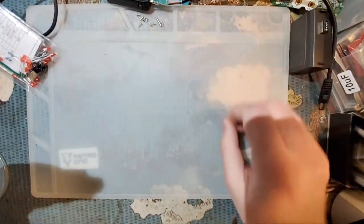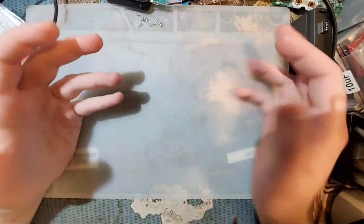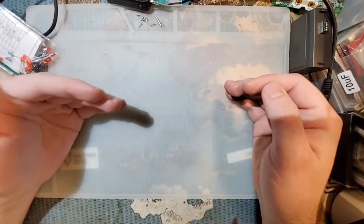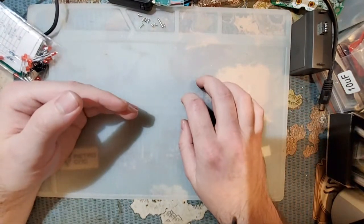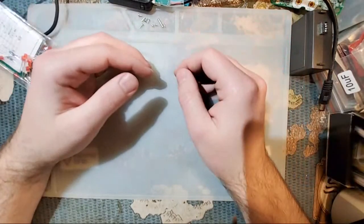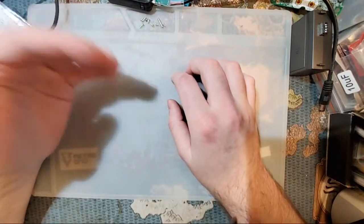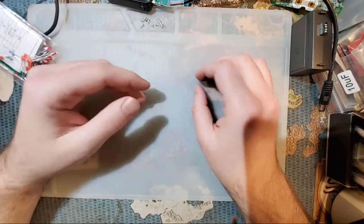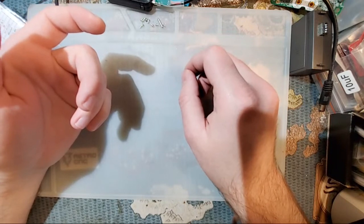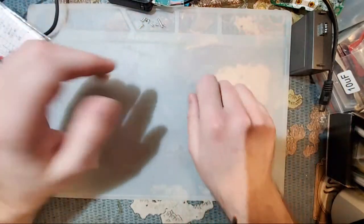Game Boy modding. Soldering is a very important part of Game Boy modding. A lot of backlight kits, if they don't require soldering, it's still heavily recommended for at least brightness controls, or in the case of the Game Boy Pocket kits, you do still need to solder, or you can use the manufacturer recommended solution of just taking the long wire and wrapping it around a battery terminal.